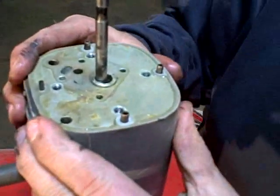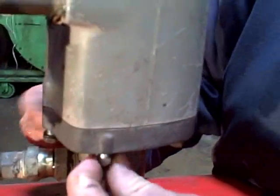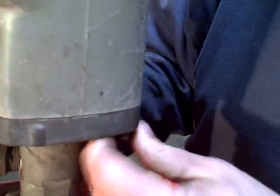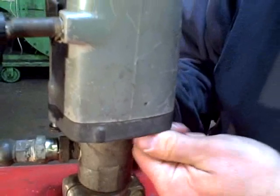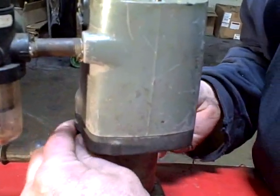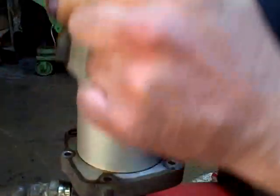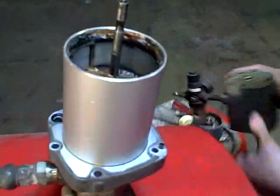Here you have your air body. Down here you have 7/16ths screws and Allen wrench screws. You remove all of these — there's three 7/16ths screws and two Allen screws. This whole assembly will then pull off. That exposes our cylinder.